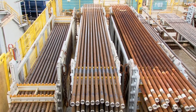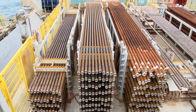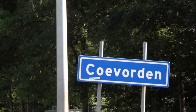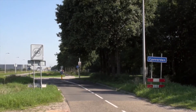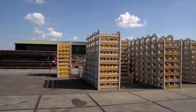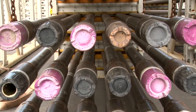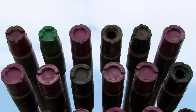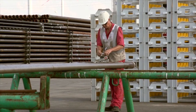The Swift 10 has a unique pipe storage and pipe handling system that uses specifically designed pipe boxes. These boxes can be used for all types of drill pipe, casing materials and production tubing. To avoid manual handling of pipe materials on the rig, all pipes are stacked on yokes in boxes in a pipe yard in Koovoorden in the eastern part of the Netherlands. Here all boxes and yokes of Swift Drilling are stored. The boxes are specially designed and tested to make sure the pipes cannot slide out of the boxes. Each pipe is measured and its position is recorded together with the position of the yoke and the serial number of the box.